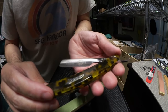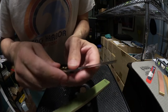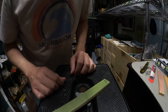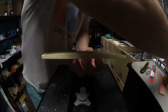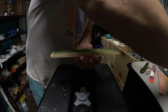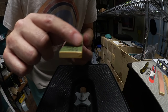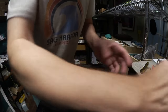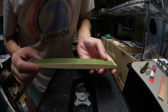I am honing your Barbarossa that you've purchased from thesuperiorshave.com. This is a shortened blade, 5/8ths with no shoulder. To take over most of the incumbent bevel, I have these strips of convex wood, as you can see. It is quite convex. The shape down this way is 6 and a half feet, and there's a teeny tiny bit of convexity going across it that way, 25 feet. They are 1 inch wide. This one is 8 inches long, the other two are 6 inches long, and this is 3M lapping film with adhesive that's been glued onto this block.